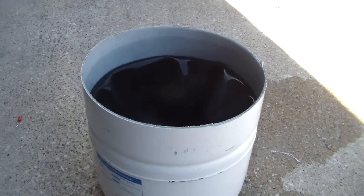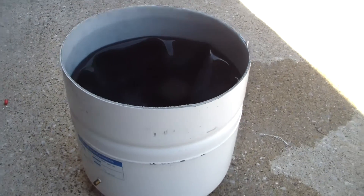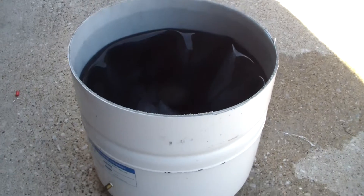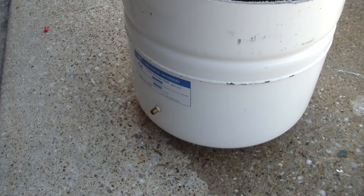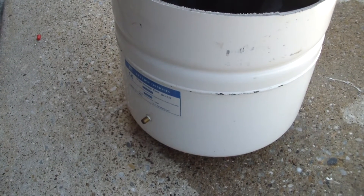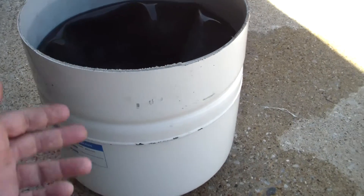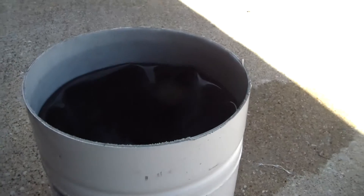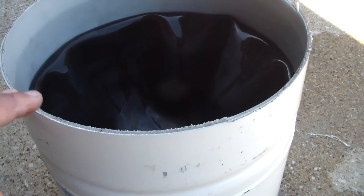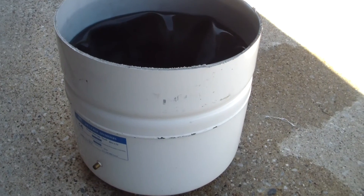That's pretty much the main purpose of this — to see what was going to be on the inside of this tank after 16 years. I expected to find it built up with slime, sludge, and calcium, but it's not. I also expected to find a leak in the bladder, but I didn't — so I don't know why it would only give us a couple cups of water. Every time I'd air this up to the 7 or 8 PSI it calls for, it would only last about a day and still only give us a couple cups. I ordered a new one, put it in, works like a champ — we get four gallons easy out of it. These tanks are only about $34 on Amazon. There you have it: a plastic liner inside a steel tank with a bladder.